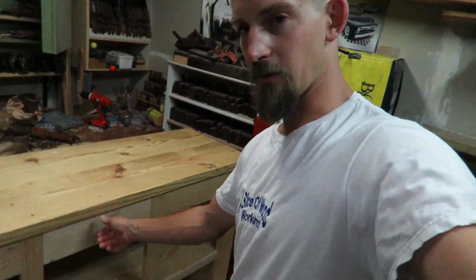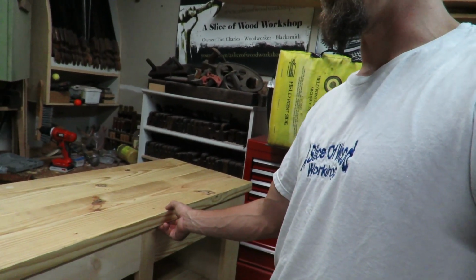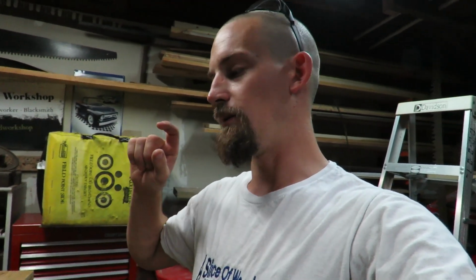One thing that I want to note is that if this was going to be a stained project or just plain sealed, whatever, clear coat, there would be no way that I would be putting that many screws in there. I would have gone a different direction, maybe gotten two 1x10s and layered them up, and then around the front you could come around with like a 1x2 like the floor, and just made your own front molding piece around the edge. That's how I did our countertops. Our countertop in the house has 2 pieces of plywood, and I wrapped molding around the front edge of that to give it the thicker look, but it was much easier to use.